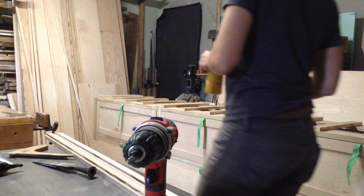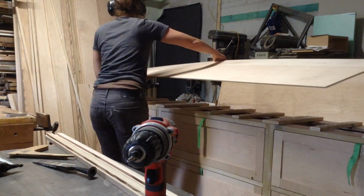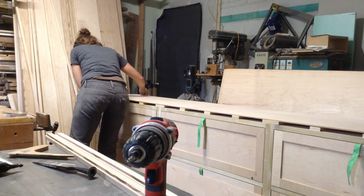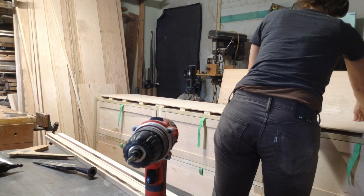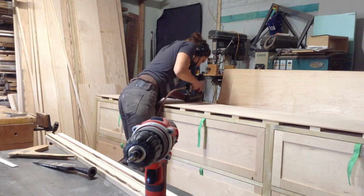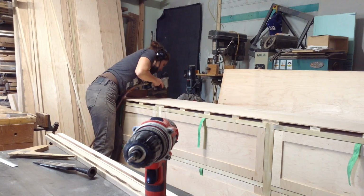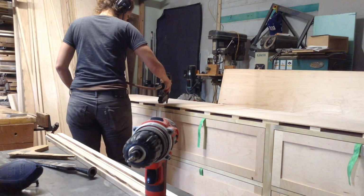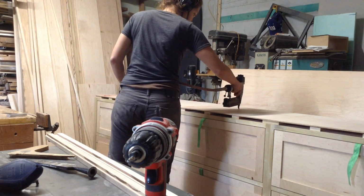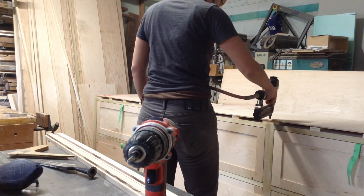Like I said, I didn't go through and make a full true torsion box because there was really no point. I basically just needed these pieces of plywood to give me the thickness I needed for the piece. So I'm just going to glue this 1/4-inch maple veneer on top, and basically I'm going to have a little bit of a shallow groove in the front, which that maple trim I made will set in. So the important part of this is the back of this top piece of ply sits right at the back of my plywood shims, and then I'm just going to put a bunch of brads in it.